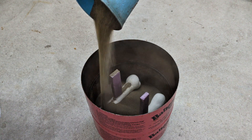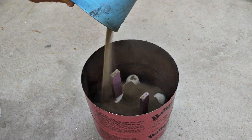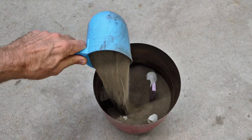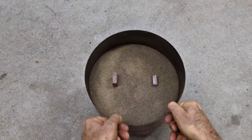You could probably see the dust coming out of the bucket from the sand — that's how dry it really is. You bury the foam in the sand, you vibrate the container to get a good compaction around the foam, and once it is filled all the way to the top you put some pouring cups on the top — that is where you're going to be pouring the molten metal. After this step is complete, it is then time to melt down some aluminum.